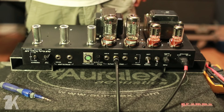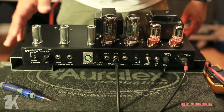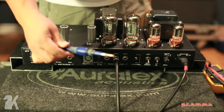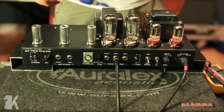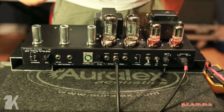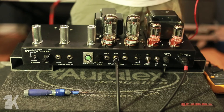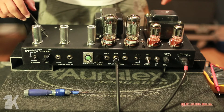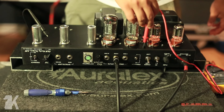We turned on the unit and it's been cooking — the tubes and voltage are stabilizing. We have it on high power, on and off standby into the load. This is the only screwdriver I could find that could reach all the way into the bias pot. I put a little electrical tape on it because an electrician said that was a good idea since it had a little bit of metal but a plastic handle. Working with one hand in my pocket always. We're going to grab our multimeter set to millivolts. I'll take one terminal — this is the ground — and move it to the holes in the chassis, which make a really good spot to place the ground.